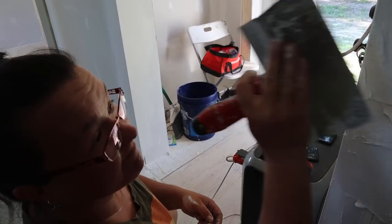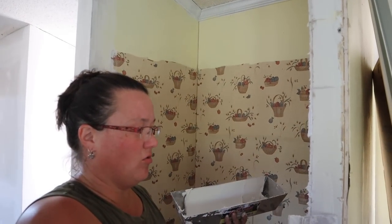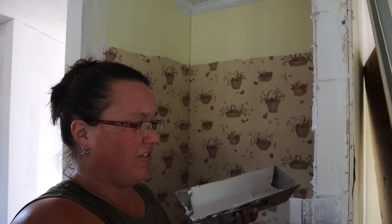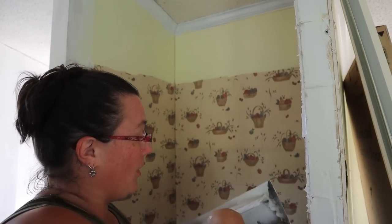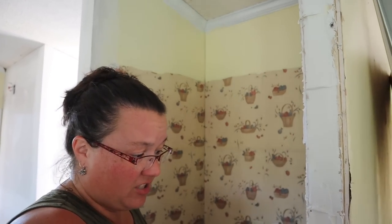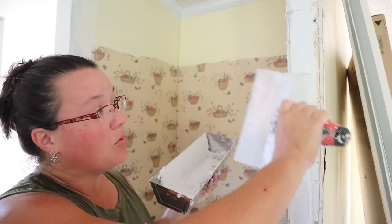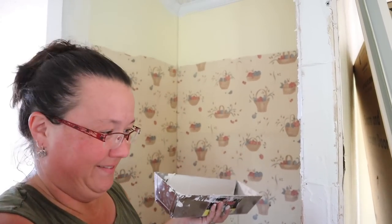Pretty much. Oh, thanks. Sam is making me share with you my technique on doing this, which I don't know that I really have a technique. I'm just kind of finding what works as I go. I didn't even watch any YouTube videos on this. But anyway, I'm just putting a bunch of mud on either side of the joint, and then I lay the piece over top of it, squeeze out as much as I can, and put it back over top, and make it thin. I don't know.